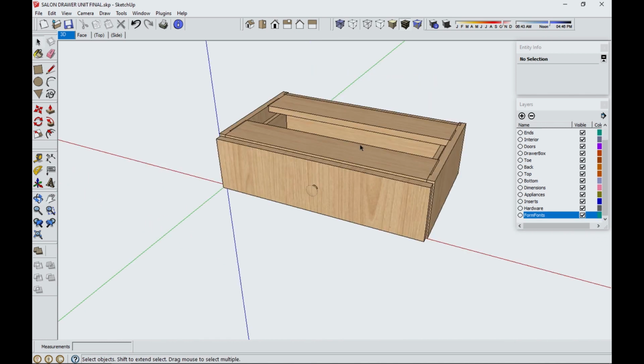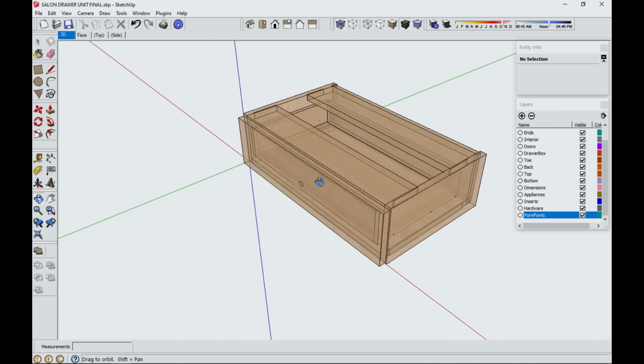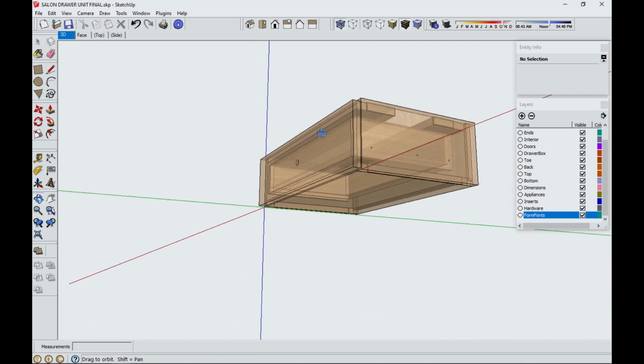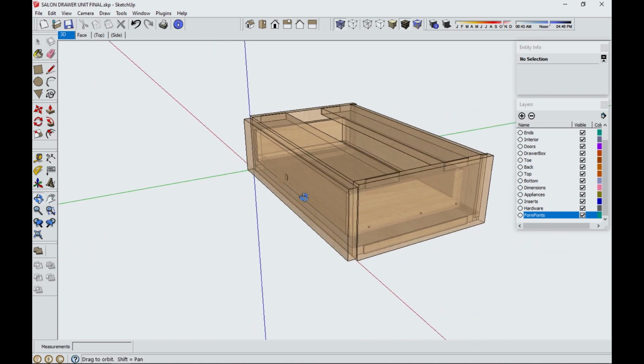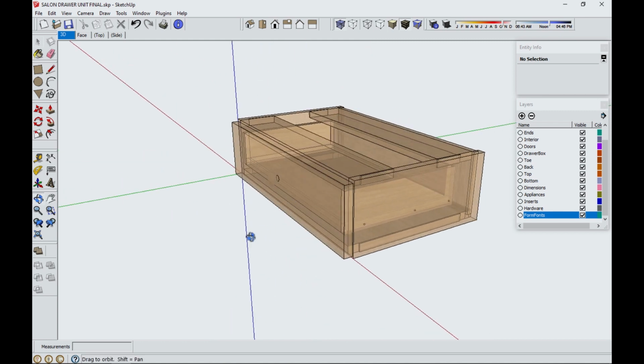This piece I call a drawer unit. It actually goes under the top and next to that other piece that we looked at. Let's x-ray it, and you can see there's a couple top stretchers. The bottom is one piece, and the reason I did that is because people view it from up underneath. And then there's a drawer, and once again, same construction. The back is inserted after the fact, and then it's half-inch material. The rest of the material is 3/4 inch Baltic birch.